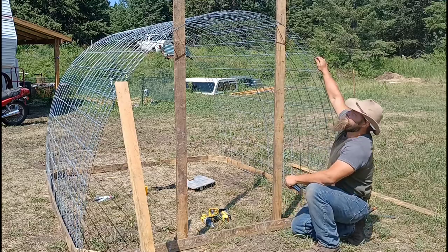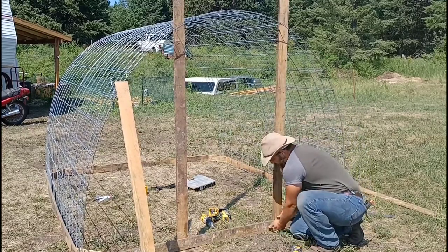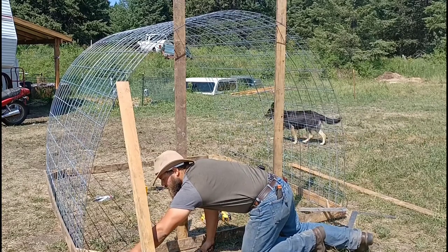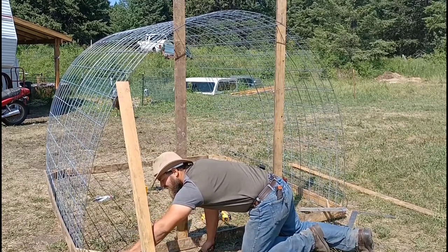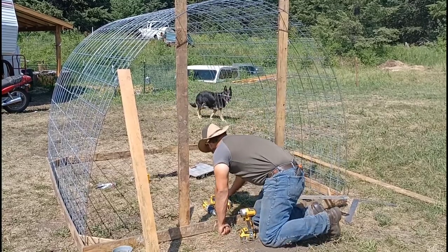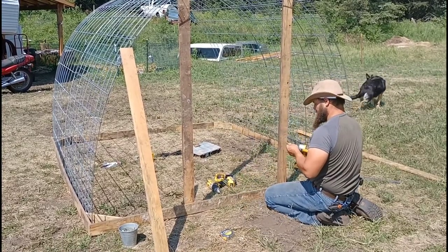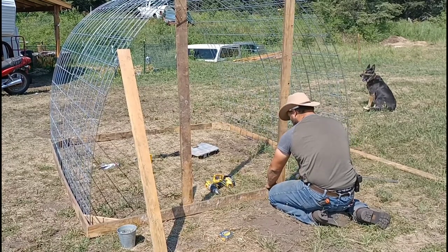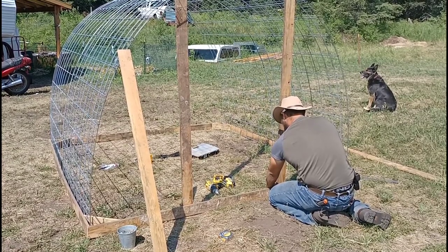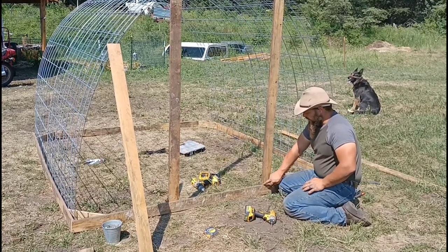Now, this hoop coop can kind of move back and forth, so I need to establish a plumb line. So I know this is my 15 3/4 inches, so I lift the board till it's flush, and I'll place one screw to hold it down here. One screw. I stuck my hands underneath, lifted the board so it's flush with the bottom, and I've marked this edge of the board right there.